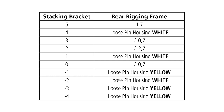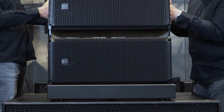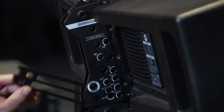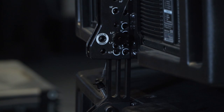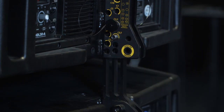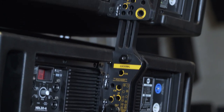For the different inclinations available, refer to the table in the manual. Following the project data, let's position the following modules. First, insert the two pins to lock the front, and then insert the rear pin in the position indicated by the project — in this case 3.7 degrees — and lift the modules until it locks in position, as for the rigging operations. Then insert the compression pin in the yellow part in the corresponding hole, in our case 3.7, following the same procedure for the following modules to complete the assembly.